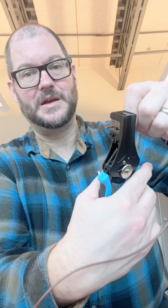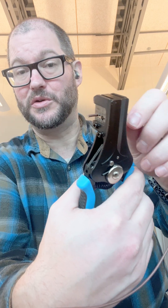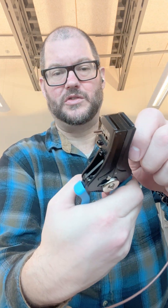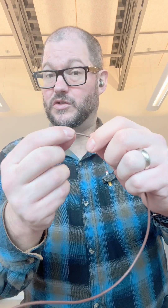Instead, I'm going to cut that damaged part of the wire off so I start with a fresh strand. I want to use the wire strippers to remove about a centimeter — roughly a pinky finger's width — of insulation. I've got the wire inside the strippers at the appropriate gauge number, and I'm going to strip it now. I have a nice clean strip, and I gripped the wire in a controlled way without pulling or stressing it. That's really what you want when stripping insulation off a wire.